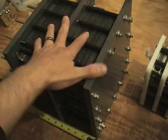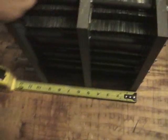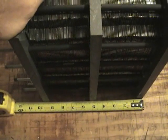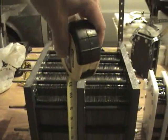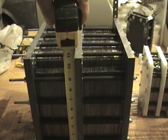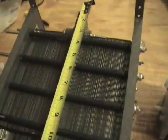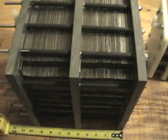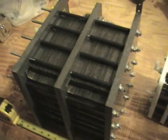This is a massive cell, and it actually measures just about 10 inches thick. So it's huge. And this is about almost 11 inches the other direction. By 11 that way. Each one of these plates in here is a 9x9 made out of 22 gauge stainless steel.